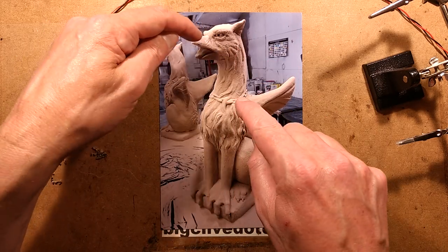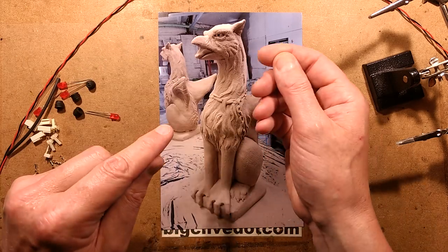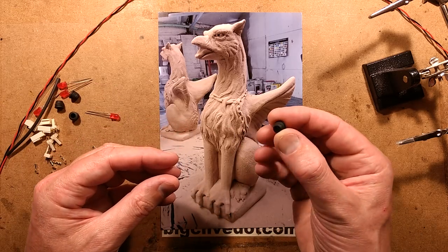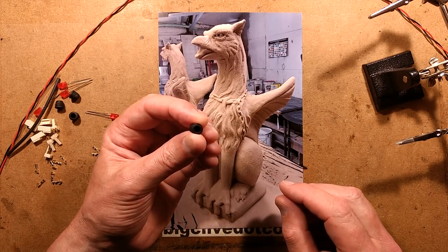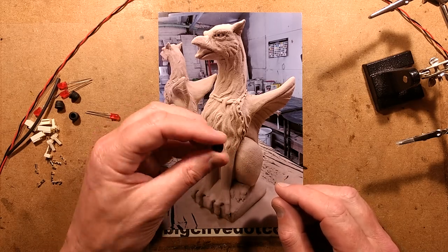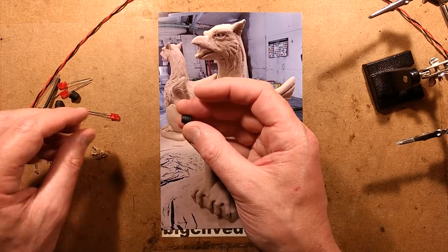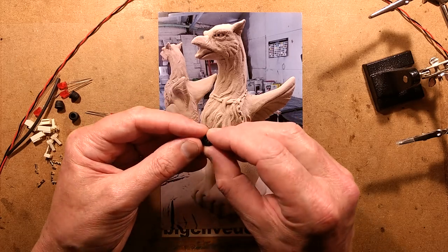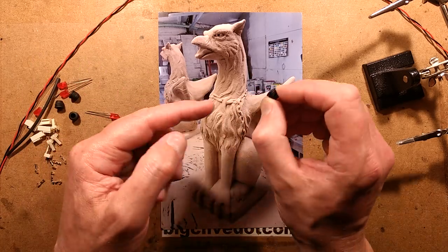He can poke a screwdriver in and get a hole into the middle, but it's quite hard — you can't get your hand up to put an LED in from the back. So what we're going to use, as I've used for other props in the past, are these little rubber grommets. These are available from a company in the UK called Rapid Electronics, about 10 pence each, stock number 55-0295. You can feed them from the front and press them into a hole, or if you make the hole the right size, you can push them from the back, allowing a complex wiring loom to just get fitted in.